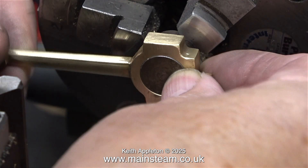This is actually wrong. Whoever machined this, machined it 5 eighths of an inch diameter and it's a perfect fit on the eccentric sheave. It's really no big deal — you can do it this way — but what you're supposed to do before you machine the part is saw it in half, clean up the edges, solder it back together, then machine the 5 eighths of an inch diameter hole through the middle. You also need to drill the holes to hold the whole thing together, just like the big end. But in this case it really doesn't matter. In this scale it's a little bit fiddly, and the good thing is by making it this way I will be able to machine an oil reservoir in the top.